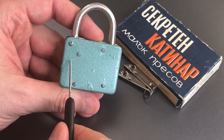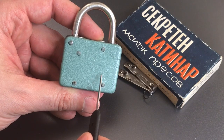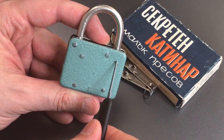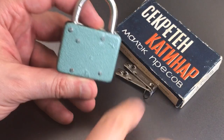four hooks — one on the end of each of the four levers — disengage and allow that carriage to slide to the right. When it slides to the right, the very top corner of that carriage, which doubles as the locking lug for this padlock, disengages the shackle and it pops open.